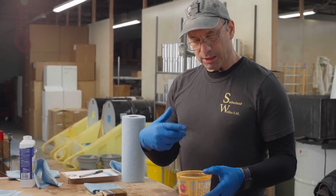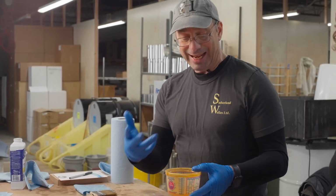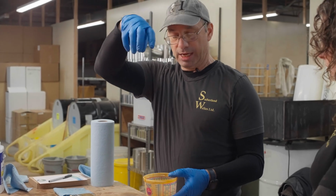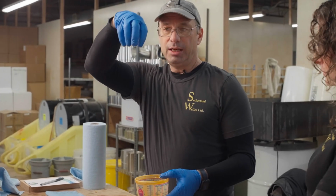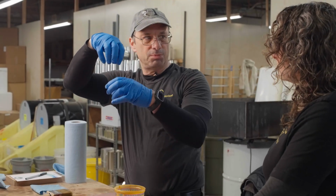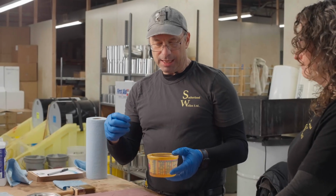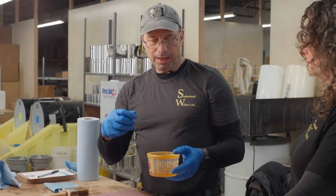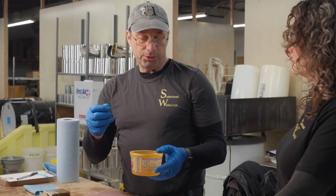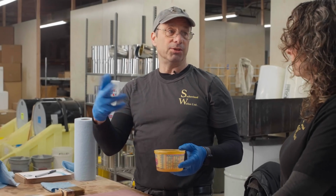The way our tung oil finish behaves is that its penetration into the wood is what creates all of its attachments to the wood. It cures inside the wood, and then when you build on top of it, you're connecting to those pieces below it. So you're ending up with a finish that isn't going to delaminate. It's not going to peel, it's not going to chip, it's going to bond to itself molecularly, so you're not going to have that trouble that people have with polyurethanes and other finishes.